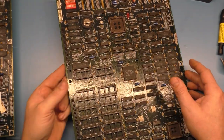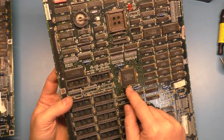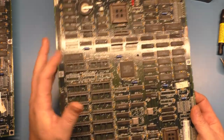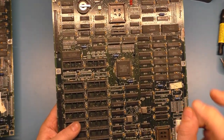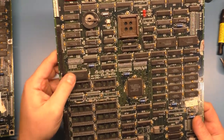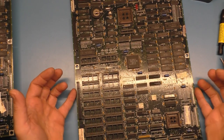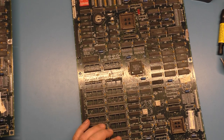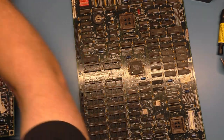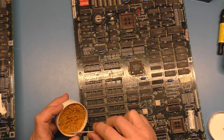Here's the parts board. This one had controller issues — looks like someone tried to reflow the UE13 controller and there's flux all over it. This is from a stack of boards I bought as parts. You can see they've already been picked clean. I'm going to see if I can steal this CMOS chip from this one using the hot air method and we'll just see how that pans out. I'll turn the iron on and while it's heating up, I'll throw a little flux on here.